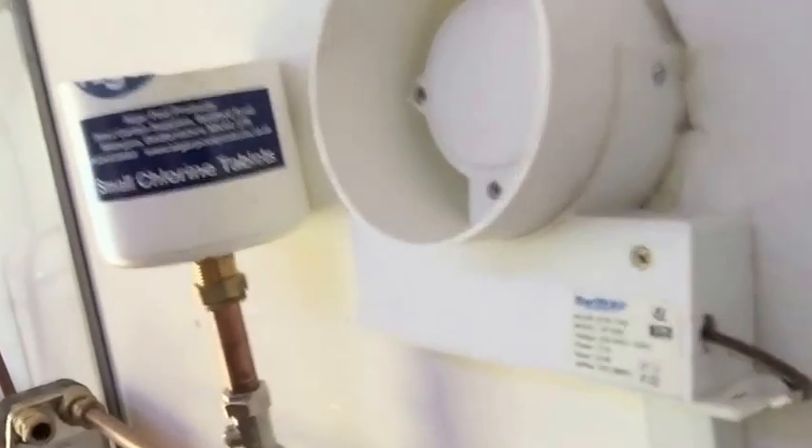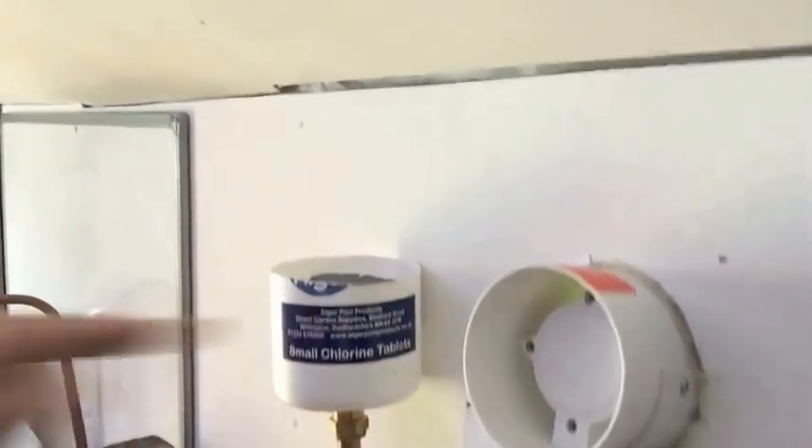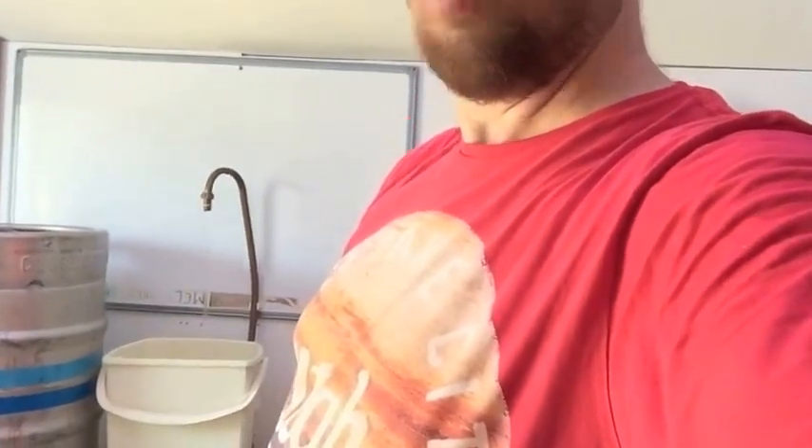So that's what it is so far. I've also got an extractor for the boil kettle. And there looks like there's an extractor up there as well - that's obviously for the room; the shed gets warm. So that's going to be the boil kettle exhaust - that's at an angle as well, so any moisture or condensation in the pipe will drop downwards and outside. So that's all in - we've got two extractors. Couple of weeks.